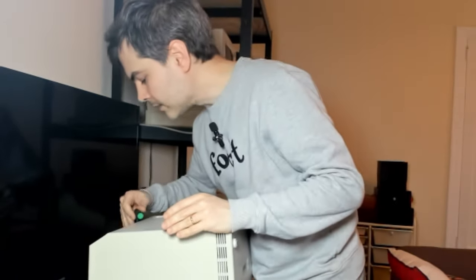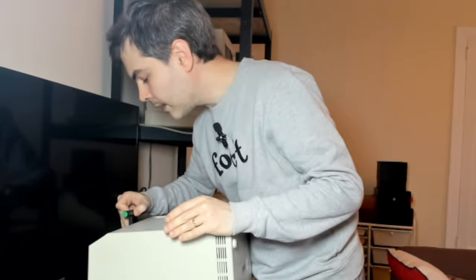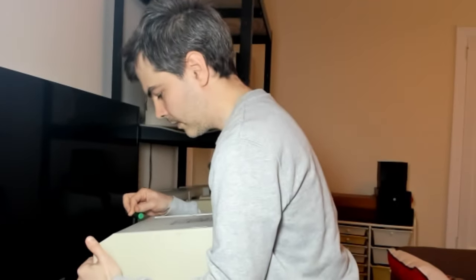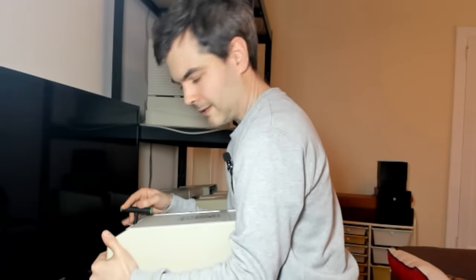And then we use the very last bezel screw as leverage. So we can push down with our Torx screwdriver as we lift the computer up a little bit while we unscrew it. And this is in order to assist with getting the bezel off from the back case, which can be very stubborn. So this is more of an art than a science.